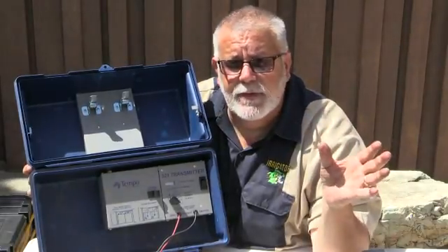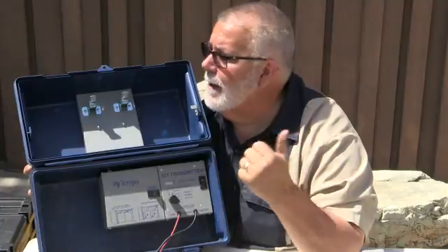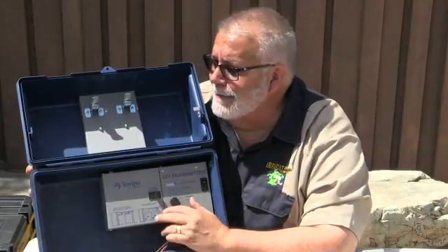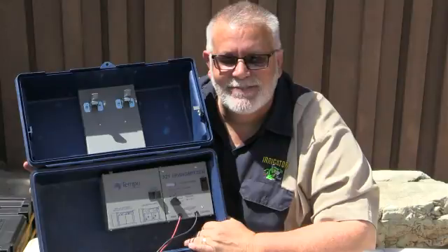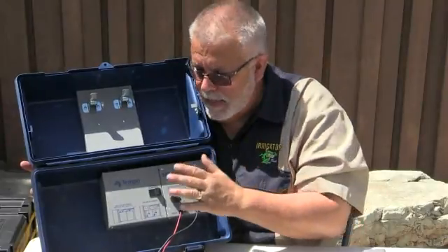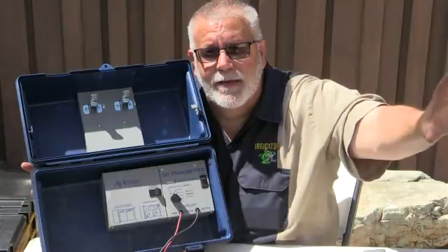The valves may be 2,000 feet away — over streets, behind bushes, by the trash cans, by transformers, all sorts of different things you have to go around. So if I kick it over to five and then I get a strong signal, that means I'm picking up the signal and it had to come from here, go all the way to where the nick is at the farthest part away. If I have a 1,000-foot run, the break is probably somewhere in the 900-foot range.